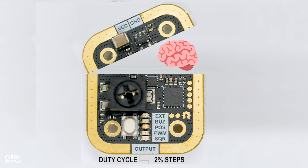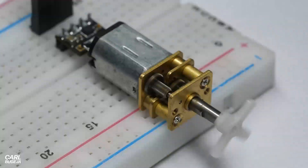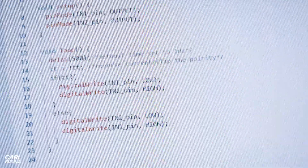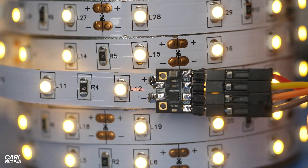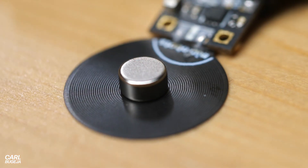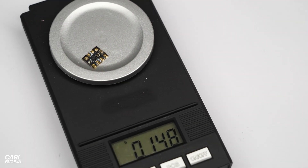But this thing alone is dumb, so what I did is take the smart elements of the other driver and put them into an Arduino library. This way people can just program it using examples and customize anything — drive a motor forward, reverse, slowly, drive PWM, go to higher frequencies, and also make buzzing sounds. This means I have a super lightweight new solution for all these actuators.